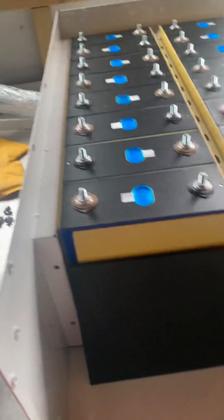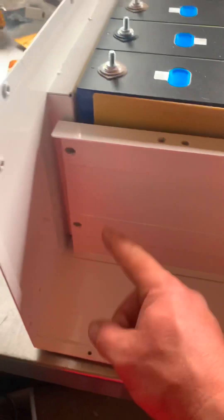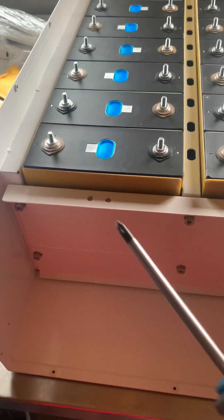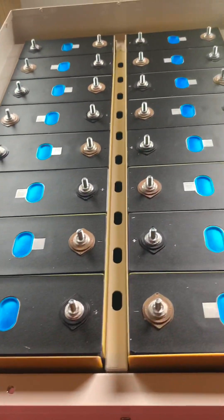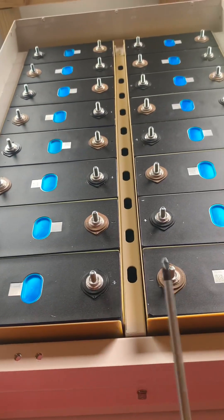I've got them out and I think they go there like that. I'm going to put that in so it's in between them so I can put the screws in. They're done up. The next bit — I'm going to put the balance bars on before I put these on, because once you connect all them up they're live, and then it becomes a very dangerous battery.